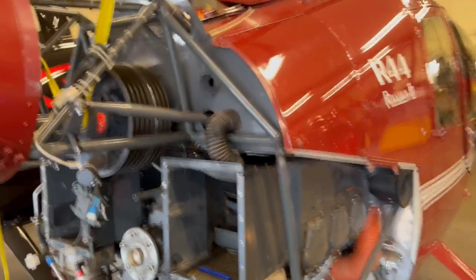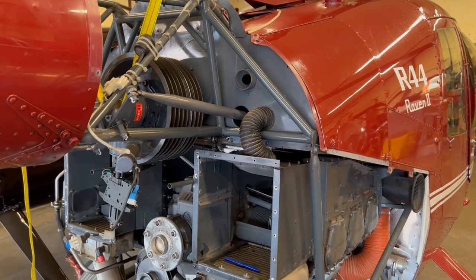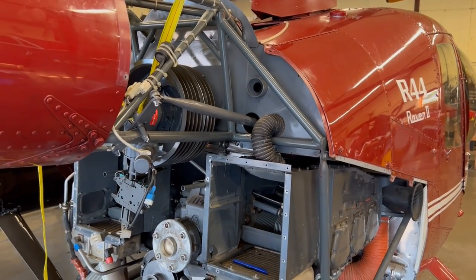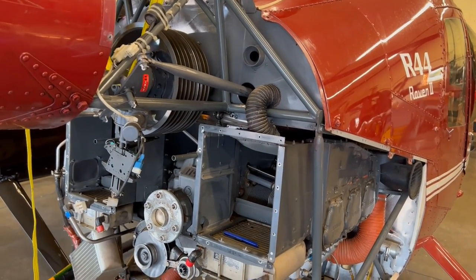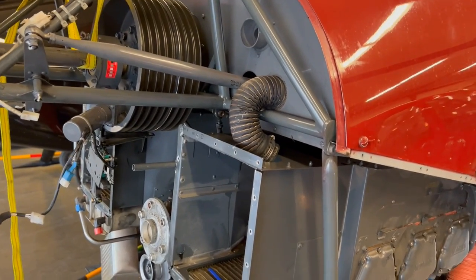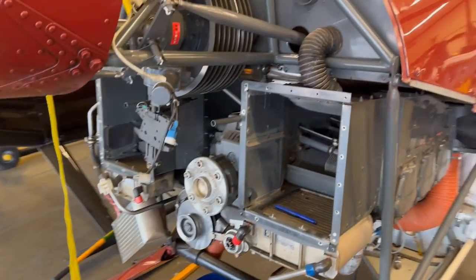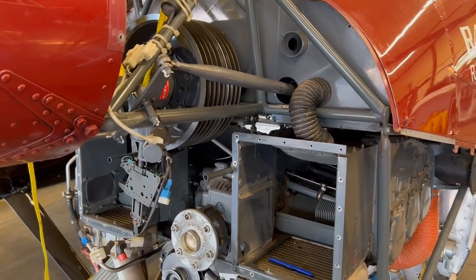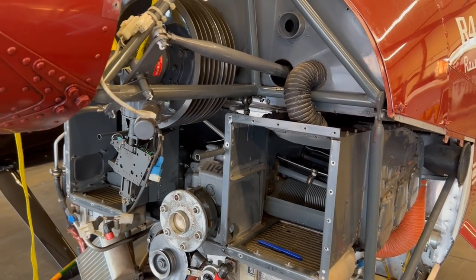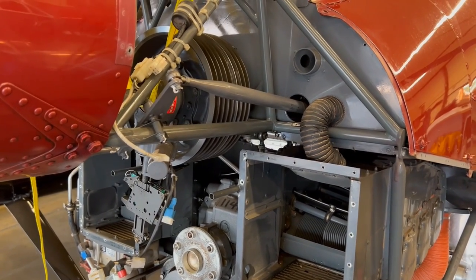It's kind of a funny story. This guy brought this aircraft here from New Mexico — we're in Missouri — that's a long way, about 7 or 8 hours of flight time. As luck would have it, the seal just started really leaking right as he got here in Missouri. This thing was leaking so much, there was so much oil on the belts that when he would pull up to about 18 inches of manifold pressure was all he could pull. If he pulled more than that, the belts would slip, he'd get a low rotor RPM, horn would come on, and made for a pretty exciting flight.